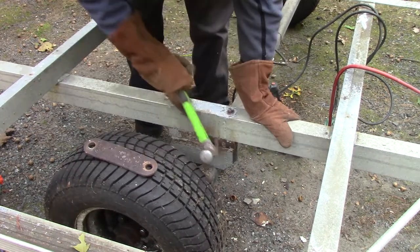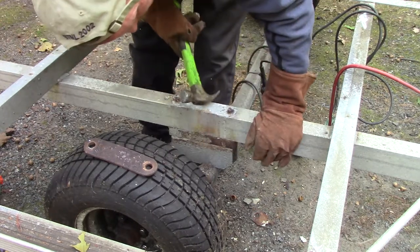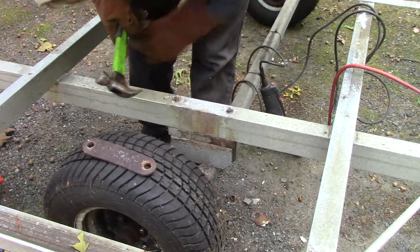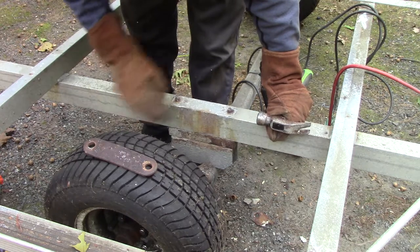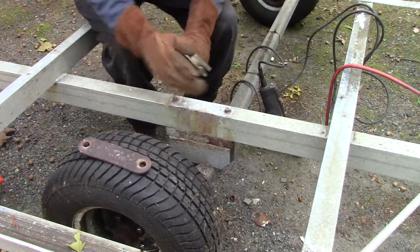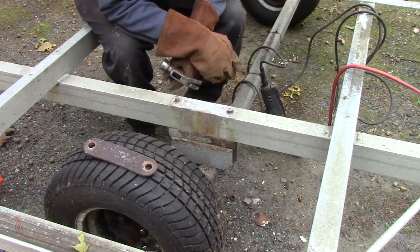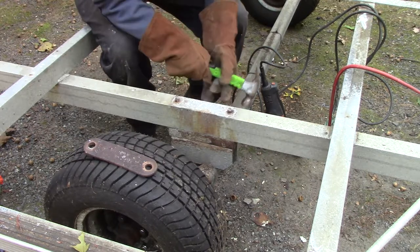The aluminum is thinned out in multiple spots - all corroded under there. Good news though: I don't see any cracks, so I might be able to reinforce this. It's definitely a major structural rail here and the axle is hooked to it. I'm going to have to get an air hammer and see if I can drive that steel plate down out of there.